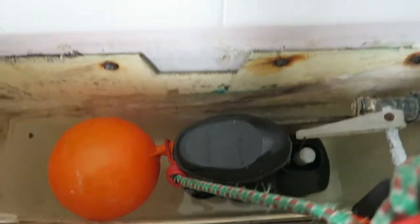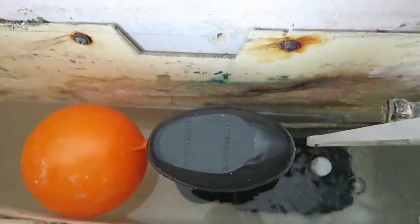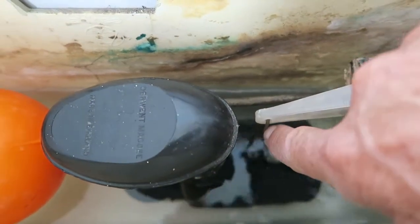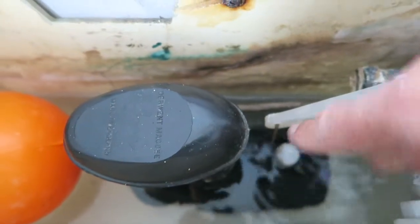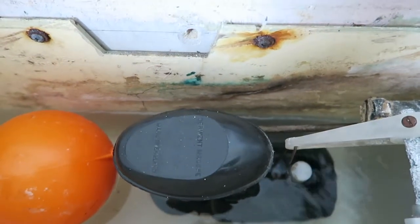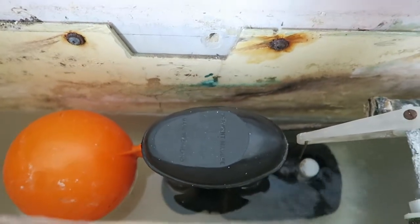Alright, siphon's back. We've got to check for leaks — check down below — any leaks? Doesn't look to be. Right, the cistern's full. This piece here I've actually replaced with an old coat hanger because the bit in there before broke, and you've seen inside the siphon the plastic membrane that had split. I've used a thicker piece of plastic from an old protective plastic mat. Should we try it? Here we go — jobs are good! Well chuffed with that, it cost me a penny and a couple of hours' work.